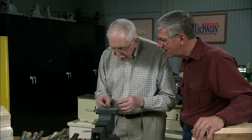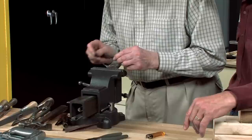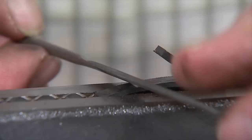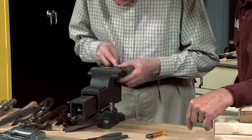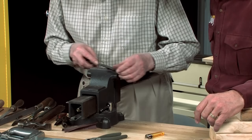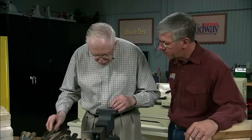Now with a knife file you can clean up inside. Just clean out any burrs and stuff that got inside. I've got some marks on it — I'll just clean those off. You can use just an ordinary Swiss file to do that. What you're doing now is basically taking off all the nicks and scratches. I've got one or two nicks in there — I'm making nothing up because I could do it later after hardening. But that's about clean enough, Larry. We're just about finished cleaning this up before we harden it. Don't want to do too much work before you know you've got a good spring.